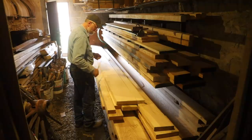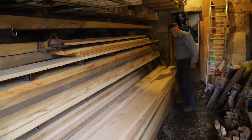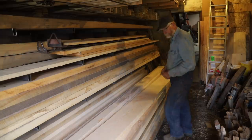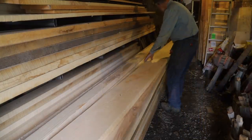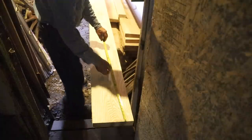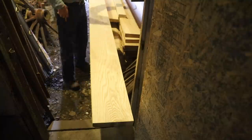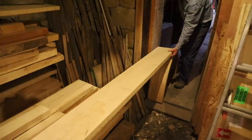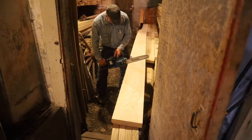Well, to keep this somewhat of a fair test, I have a piece of timber that is 10 inches wide, and it's not quite good enough for me to use in bending bows, so I'm going to take a chunk out of this and take two eveners out of this same board. A 10 inch wide board will provide me two 5 inch eveners at the center. So as much as possible, using the same board, I'm going to put these two styles of eveners to the test. Hopefully it is a somewhat fair test.